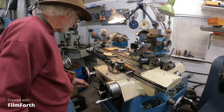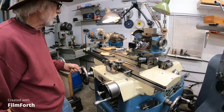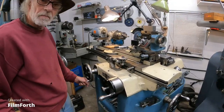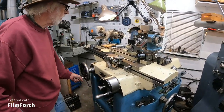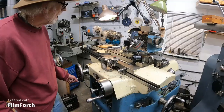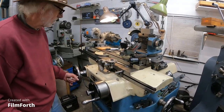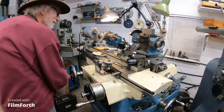One of the things I do is I crank the table before I grind, at least a few times. Just before, like I'm doing right now, I'll crank it all the way in and I'll crank it all the way out — almost all the way out. It's pretty long-winded.